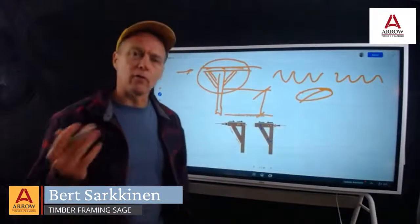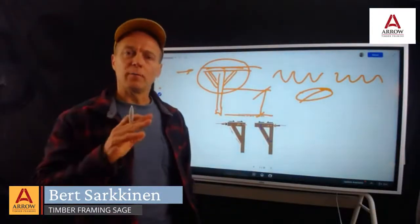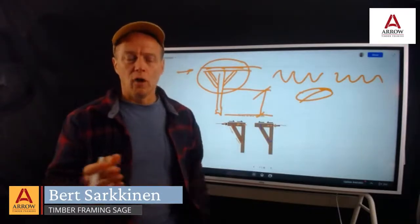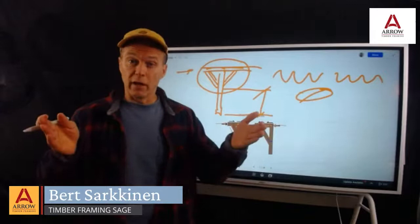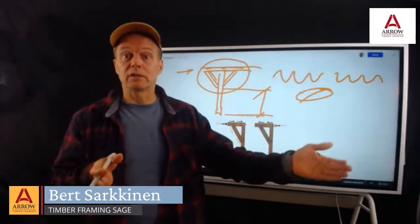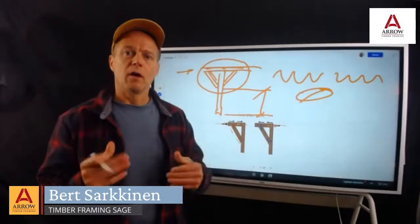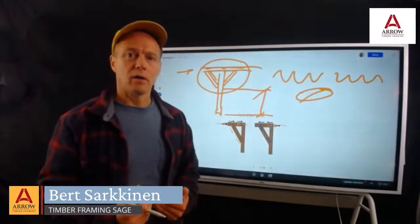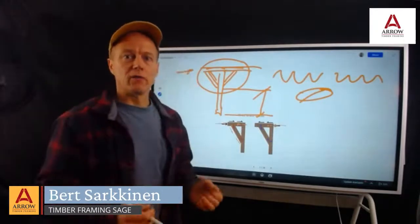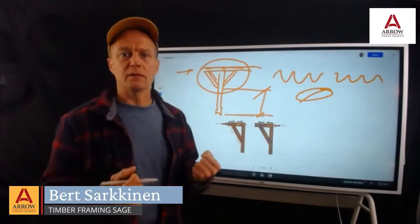Chevrolet had a car. I don't remember which model it was, but it would fall to pieces going roughly 35 miles an hour over a bridge where federal regulations stated that expansion joints had to be at a certain distance. And when the frequency of this car going 35 miles an hour matched these expansion joints over a bridge, this car would start to just buck and leap and just start to fall to pieces.